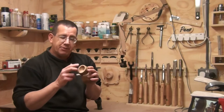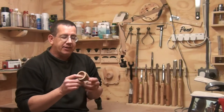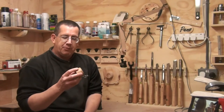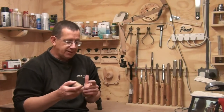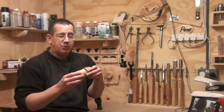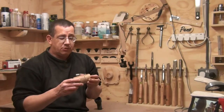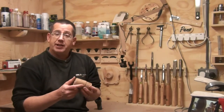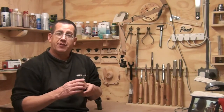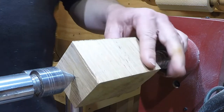It will dry out quite nicely. The lid is a little bit thick because I've done the curved section in it and had to leave the whole thing fairly thick. If it were really wet wood that might be more of a problem and I'd probably have to seal the ends, but as it wasn't too wet to start with I can leave it as it is - just open in my workshop for at least four weeks. I'll weigh it and regularly check when it loses mass to determine roughly when it's at a finishing weight.